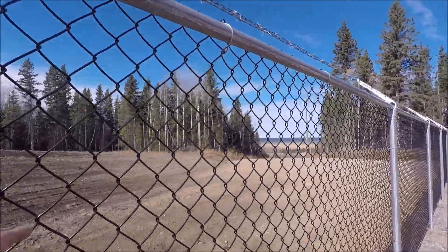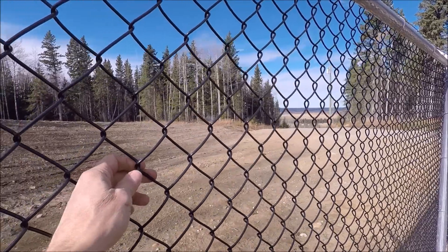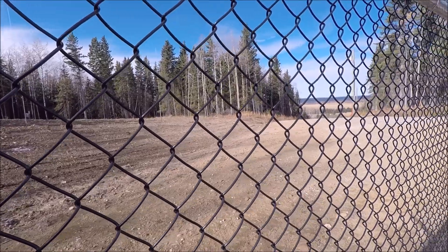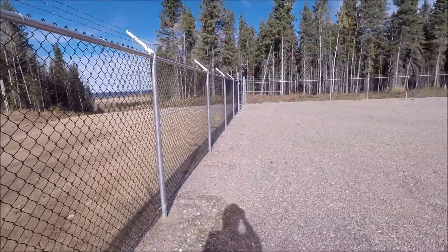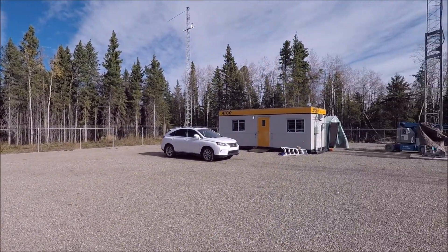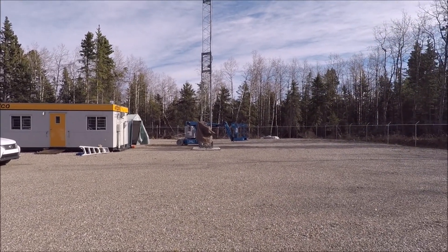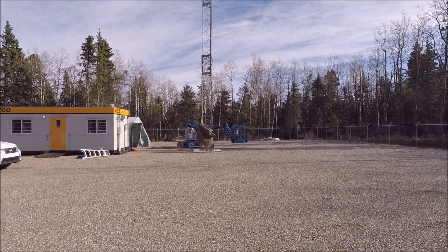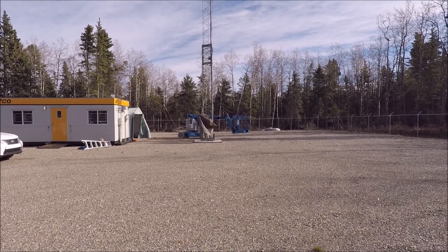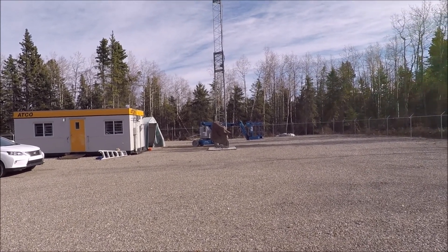The mesh of the fence is not galvanized — it's vinyl coated — and I did that purposely to avoid any potential for galvanic diode rectification effects with poor connections over the years, so I'm not worried about the vinyl coating causing any rectification problems, and so far I've not had a problem. Basically, that's the transmit antenna here. It's right at the crest of the hill — a 90-foot shunt-fed tower with the 80 meter yagi on top and about a 100-foot square ground radial system buried.